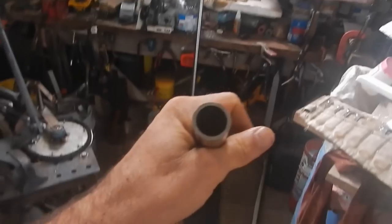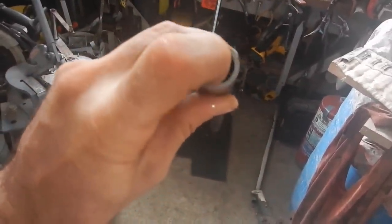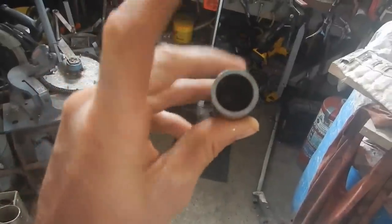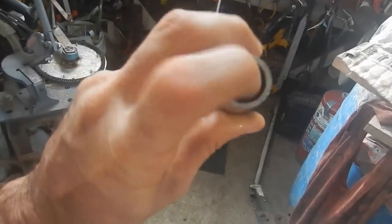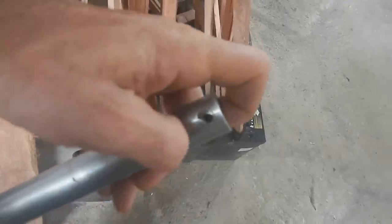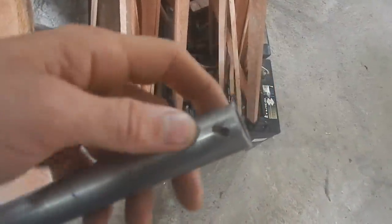This pipe is thicker walled and the motor shaft goes inside here. On the other one I had to put an insert, so maybe if I'm lucky this will fit snug, or I might have to put just a thinner insert. Or if this is tight, I can turn the motor on and hold a file up to it and use it like a lathe until it fits. Let me drill this out to quarter inch. I'm not going to drill right through to the other side until after I get it on the motor, because there's a hole through the motor shaft that I'm sure is not perfectly aligned. I'll put the motor shaft in with whatever spacer I need, get it nice and snug, then when the drill bit is through this and through the motor shaft, it will be lined up right to drill the other side.